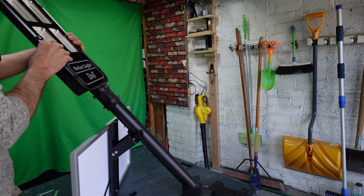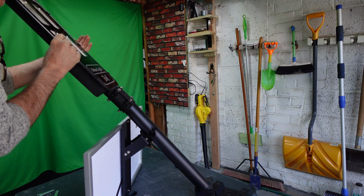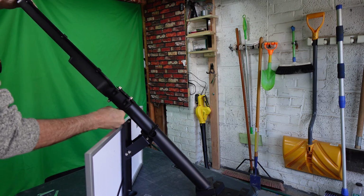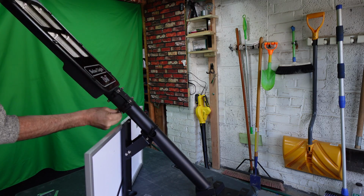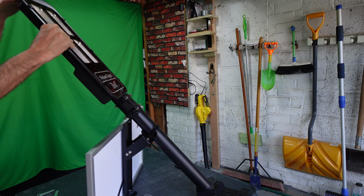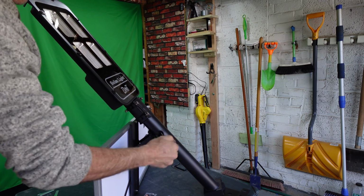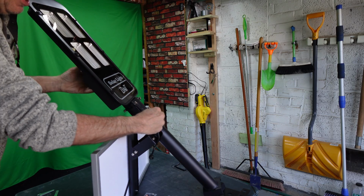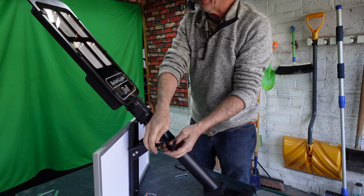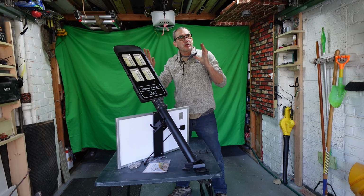and place on the head by opening up with the large Allen key. When everything's loose, all the bolts, even the bolt in the back, which is a safety bolt, and this slides on. Even the one back here, there are two of them. Slide down 100% and tighten everything up. Then all you need to do is connect your leads and your light is ready for installation.